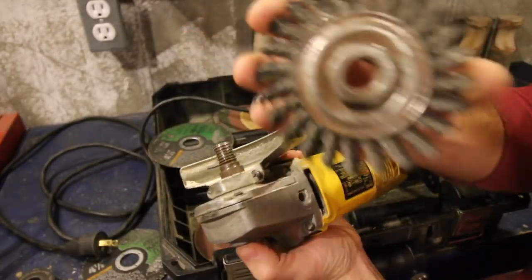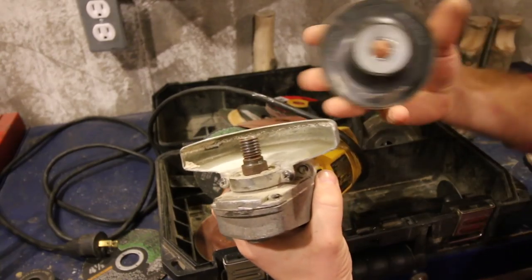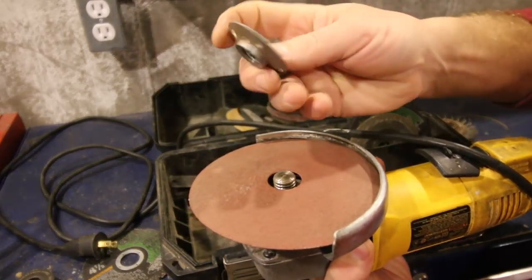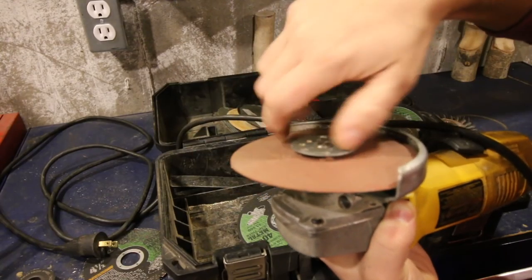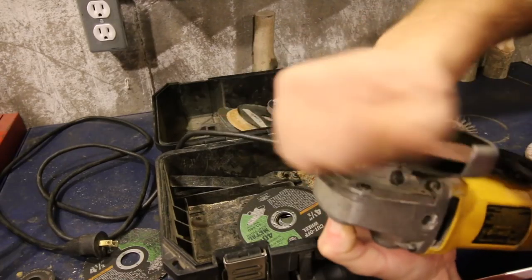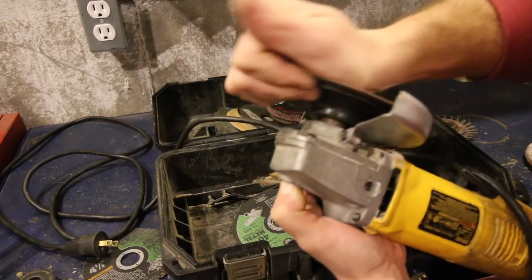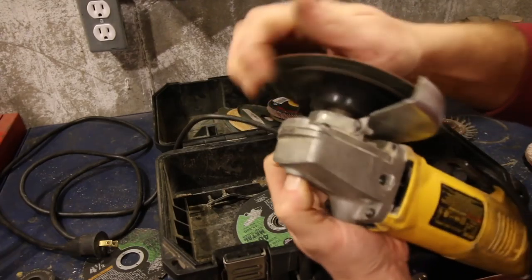On our wire wheel, it's got a threaded nut on it. The big difference is if we're using a sanding disc: we've got a backing plate, we put that on first, put our sanding disc in place, and grab our lock washer. It's tapered, so it's meant to fit in place and hold the sandpaper down. You can either just spin the sandpaper to tighten it up, but it also comes with a wrench — I find it more convenient just to hand tighten it. To take it off, push your button in and loosen it up.